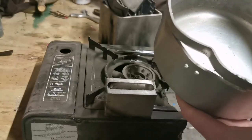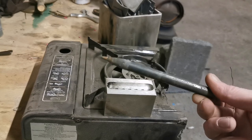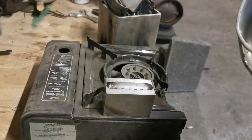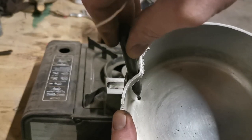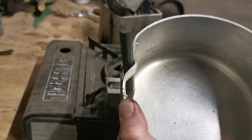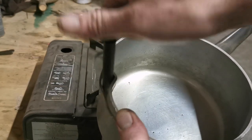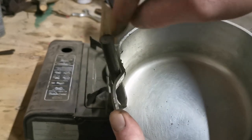We tap this bit in, and the second part of what we need is this — a piece of steel bar sharpened down to a point. That allows the point to drop into that hole, and it's a very simple plug system. That should be enough to stop any lead leaking out. If it's not, sometimes a small hammer and a few taps will help the aluminium mould to the shape of the steel bar, and that should seal it up.